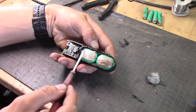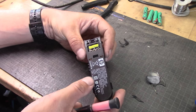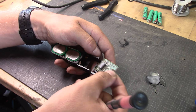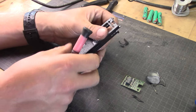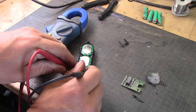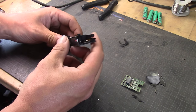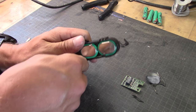Inside here we can see two batteries at least, and I'm guessing there are two in each slot. Let's get them out, but before we do we should remove this PCB — that's really simple, just take this clip and pry it a little bit and you can lift the board up and out. Here you can actually see the battery sticking out. Let's measure the voltage of this battery. This battery is basically zero — there's nothing. This is shorted. So let's get the batteries out. They are glued in here so they can be a little tricky to get out.